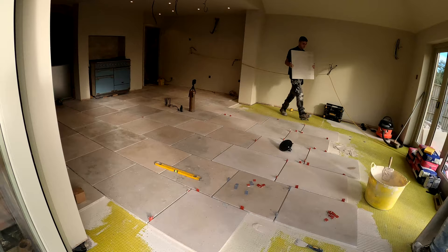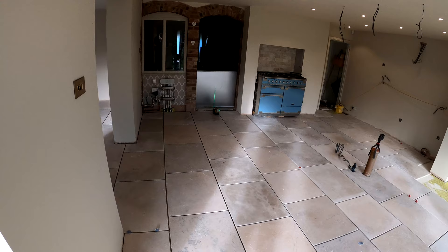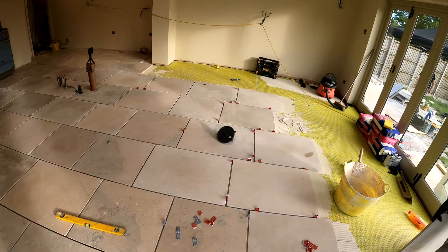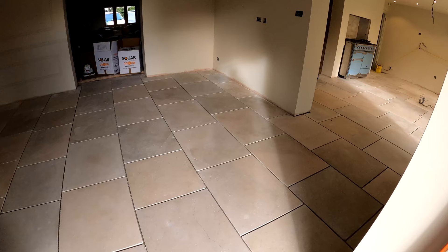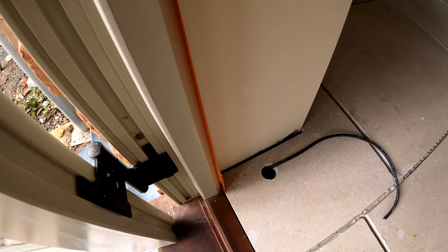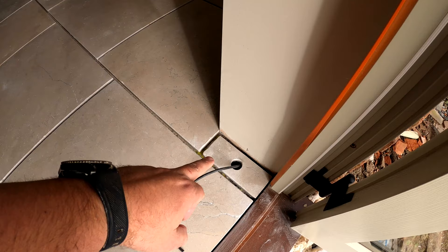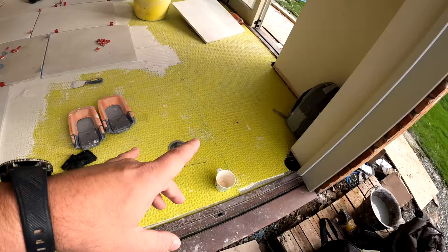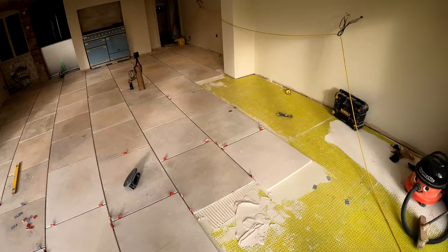Still got our rig set up out here. Just a few left through here. Guys have already made a start. We've managed to get all this space done here — through here it's all done. We've got our beam there still set on this line, coming all the way through there. We're still bang on that, which is great. Alex is just out there getting some cuts, T's getting all the tiles ready. We managed to get all this in as well — this is 20mm limestone there, the 600mm by random lengths. We've done a 30mm hole here for our lights. We've got one there and one there — specifically 30mm back from this way and then centre of where this reveal is, mirrored on both sides. We've also got them here and there and another one there and another one there — I think it's just to illuminate up and over the top here. It's going to look really nice actually when that's all in.